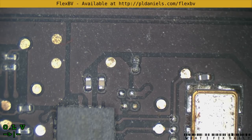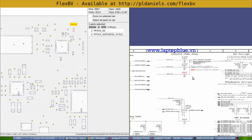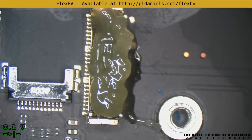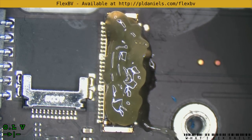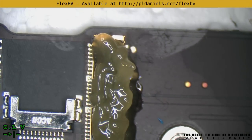Let's have a look at what that resistor is. PP3V3S5 — and you're just a link. Looks like I missed the last minute or two of commentary because I was too busy on the board view. But basically what we're going to do is just hot-flux this up and take it from there. I'm really hoping we don't have to replace this because trying to replace it is a risk — with this connector and the power connector, the amount of heat to get this off is not insignificant.